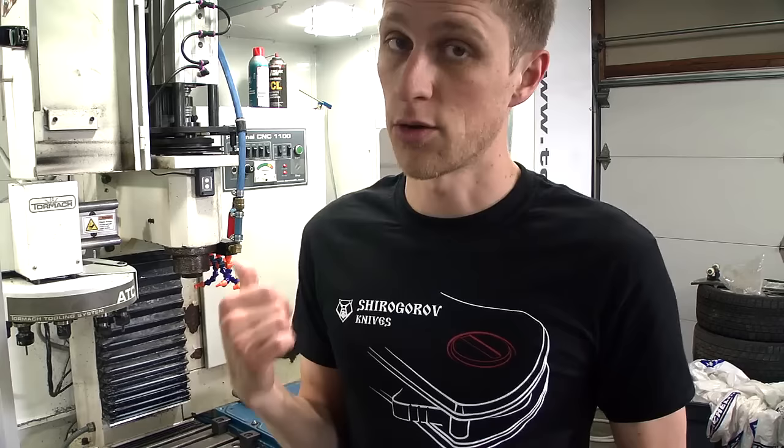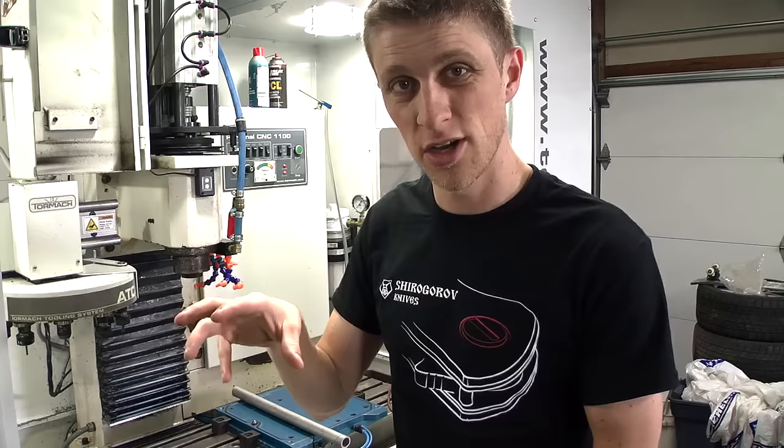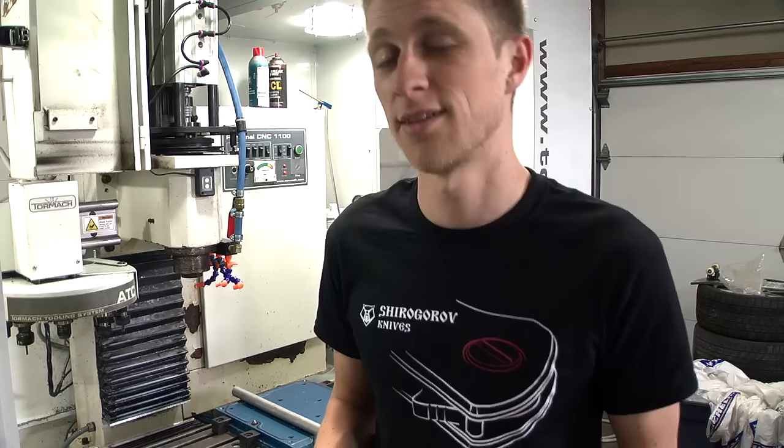So the old coolant made a lot of rust. Running that crappy coolant and often letting it run too lean — which means it's mostly just water — and water equals rust. I've had a lot of rust on this machine especially around the spindle nose right here, and when you get in real close on those shots with the camera all you see is rust and it looks stupid and I don't like it.